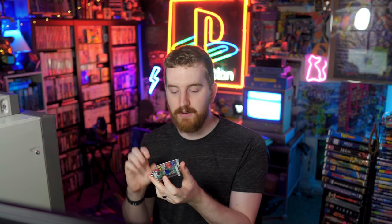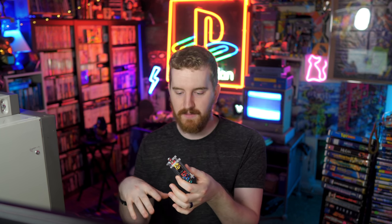What this device actually does is take your analog video signals, which are not compatible with normal HDMI formats, and output a lag-free 480p signal. It'll either line double your 240p games up to 480p, or de-interlace your 480i games to 480p. It won't accept 480p input unfortunately. It then outputs that via mini HDMI or full-size HDMI, depending on which model you get, to either your capture card or TV. This makes it much more compatible with TVs and capture cards, because most capture cards I've reviewed work fine with 480p — a 720x480, 60fps signal, ready to rock and roll to stream.